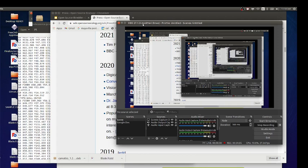For the brick press, there's a flow sequence. You've got soil in the hopper and a cylinder that's the drawer, called the soil loading drawer. It slides back and forth, opening up the compression chamber and closing it. You compress, open it, eject, and press that brick out as the next soil drops. So there are a few motions there, a very particular logic sequence. What's the volume of the soil versus the brick? You compress it down to about 2:1. So you start with about 8 by 6 by 12, where the 6 by 12 is the flat face of the block.